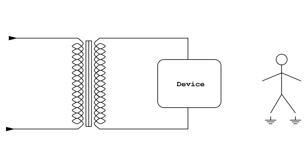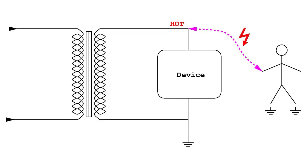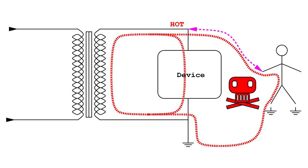While testing electronics that work directly connected to the mains, it is a good practice to put an isolation transformer before it to avoid the chance to let a current traverse the body of the operator between the ground and the item under test. This is all good except that, if something of such an electrical device under test is connected to the external ground, if the operator touches something else of the circuit of this item under test, which has a significant potential compared to ground, the operator would be traversed by a current.